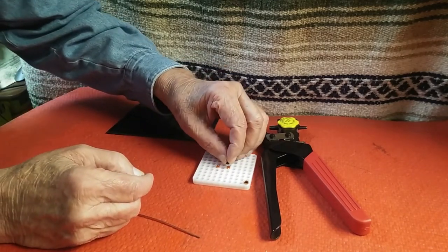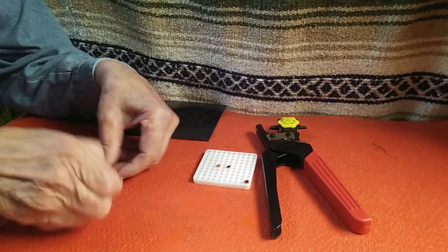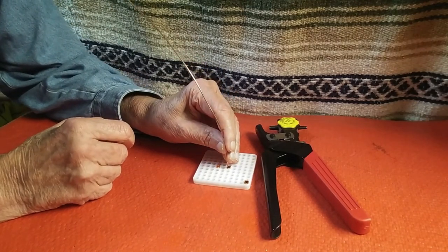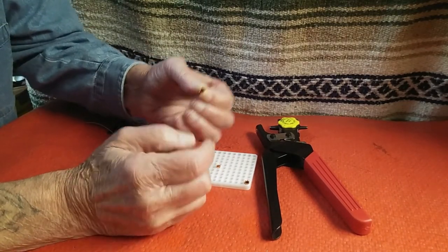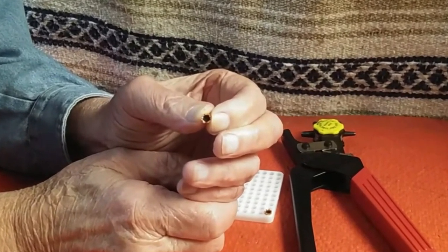Well, there you go. I have shown you my two methods of making percussion cap nipple protectors, one using an ordinary aluminum can and the other using copper sheeting. Now, you can install the nipple protector on your favorite side lock percussion firearm and dry fire it without concerning yourself with damaging the cones.